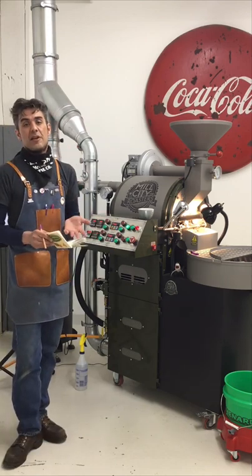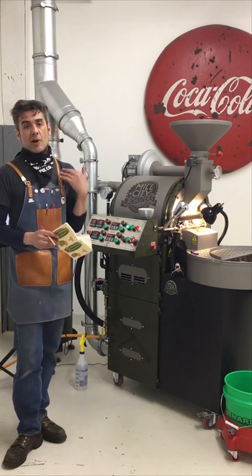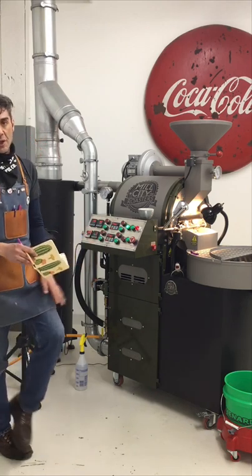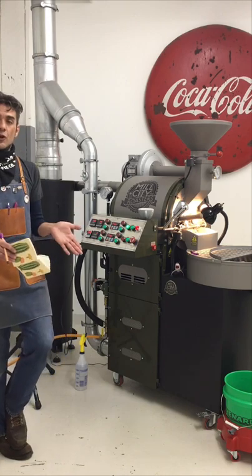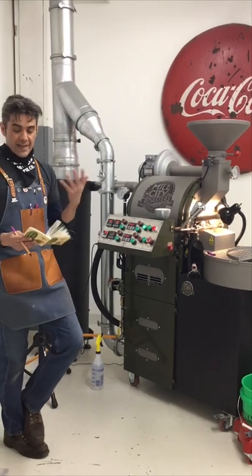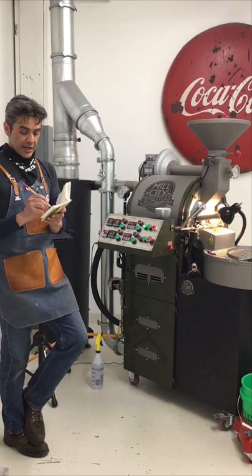The last question is going to be drum speed — what kind of drum speed are we running? That question isn't about hertz; it's about actual drum speed. On this one I have it at 45 hertz, but I've already done a hard count on the drum rotation, and roughly this one at 45 hertz is around 65 RPMs drum speed. So we're running about 65 RPMs.